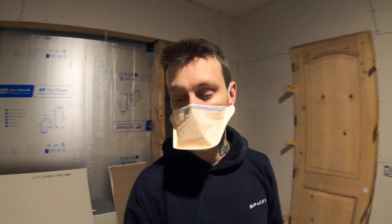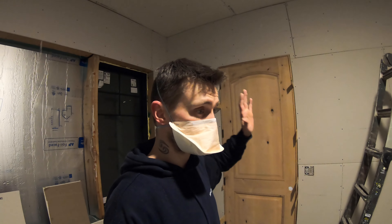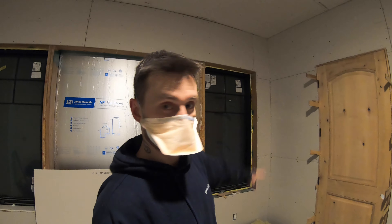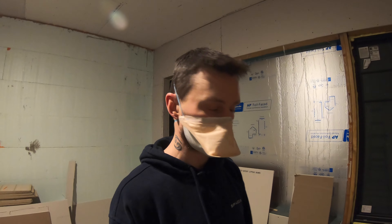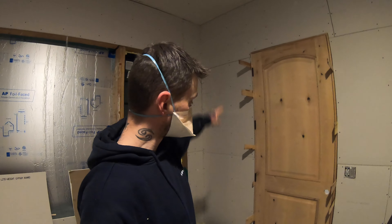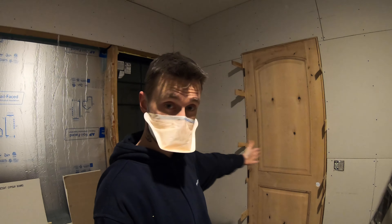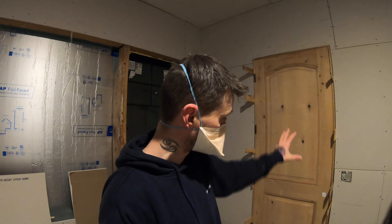I'm going to finish playing out here tonight and then I'll see you guys back tomorrow or another day this week. Before I forget — let me know what you guys think about this. I've seen some people with big doors who want them more secure. What do you guys think about on the inside of the gaps where the shims are, putting window and door spray foam? That way you're not just relying on your screws, you're basically gluing the door to the frame. Should you secure a door better — even though it's on the inside — put spray foam up and around the frame, so you glue it and hold a much better, tighter door? Especially because we have such big doors — eight foot tall by 36 inches, and this door frame is almost seven and a half inches wide to accommodate all the drywall.